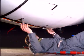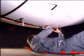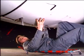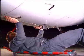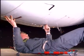Make sure that the hooks are released from the latch handles. Push the doors together and engage the latch hooks with their keepers. First close the front latch, then the centre and the rear ones.